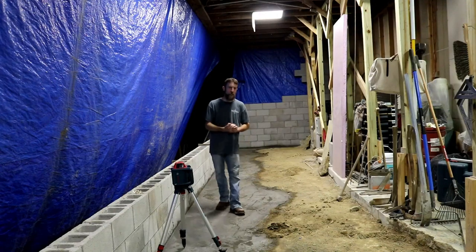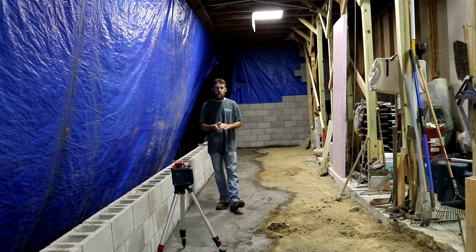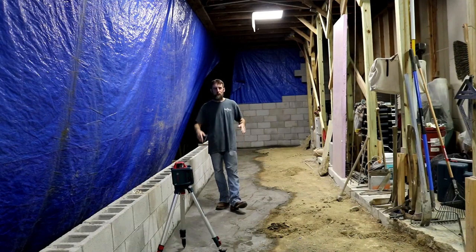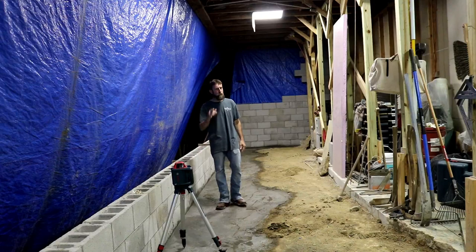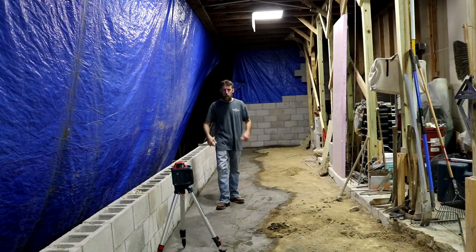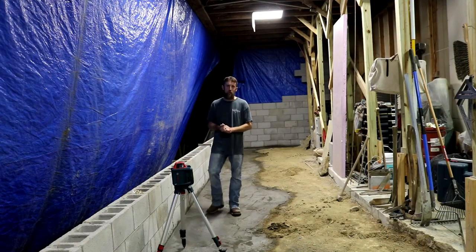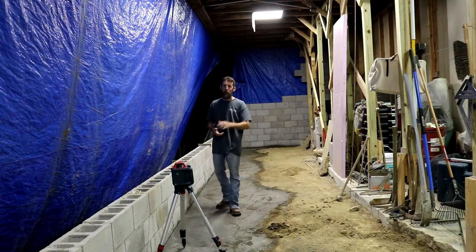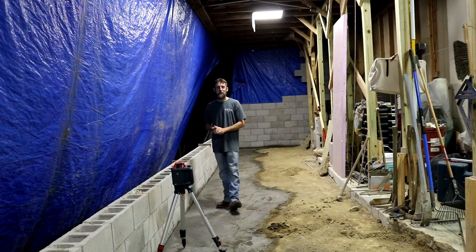So, I think that's it. I'd suggest this stuff to anybody who's considering filling in below a pad, maybe filling in a hole or around a foundation. It really worked well. Didn't move quite as easy as I thought it would. I was a little surprised, but it worked out. We got it where it needed to go, and it wasn't that bad. It was easier to move than concrete, that's for sure, than the concrete with number 57s in it. Man, that stuff will kill you.